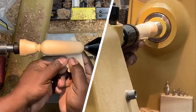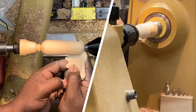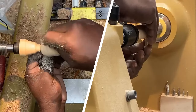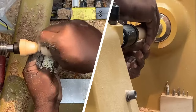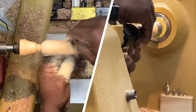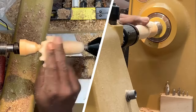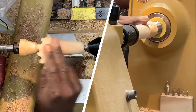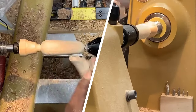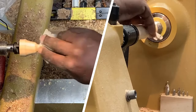Okay. And let's go ahead and sand this. Now, when you're sanding, especially something like pine on the lathe, it's fine to do your fairing of the surfaces and things with sandpaper. And it's all right to do it on the lathe while it's spinning. But that leaves a very noticeable radial scratch pattern. And so what you want to do is once you get it shaped the way you want it, turn it off, and you're going to have a lot of scratches that run this way. So take a little bit of time and just sand with the grain with that current grit. That's going to go a long way to get rid of a lot of those radial scratches. Okay. Again, it's a clamp handle, so how persnickety you want to get with this is really up to you.